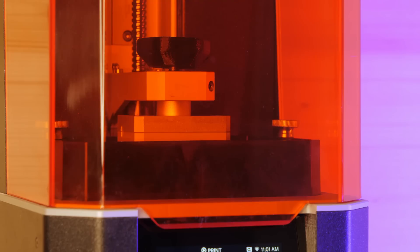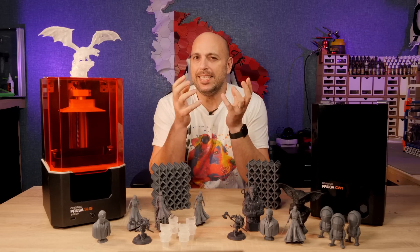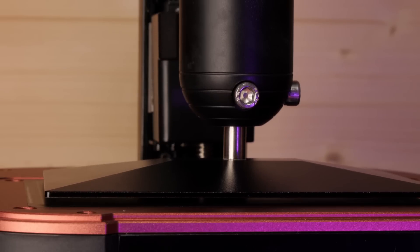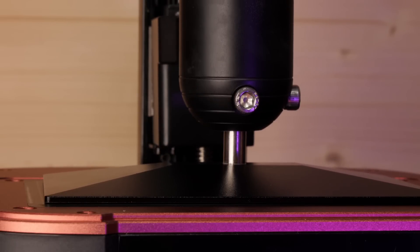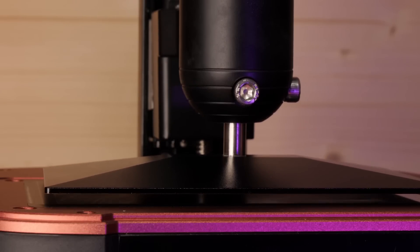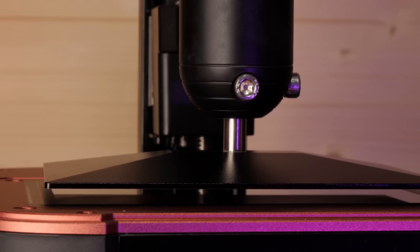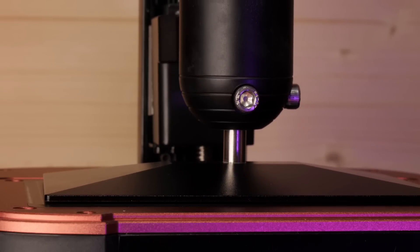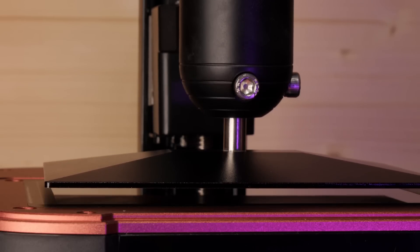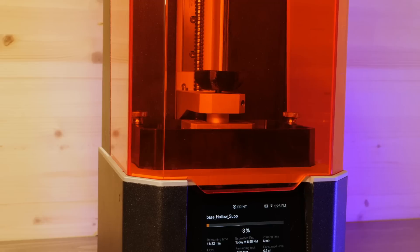This is achieved thanks to the tilting VAT mechanism. The way most standard MSLA resin printers work is that they have to first gently raise the bed in order to release the cured layer from the FEP film. The forces here are insane as the full layer has to be lifted simultaneously — think of the process like trying to pull a plunger straight up. After that the platform has to be raised another 8 to 10 millimeters to allow resin to seep back in under the print, followed by the build plate being lowered back into the resin to start curing the next layer.